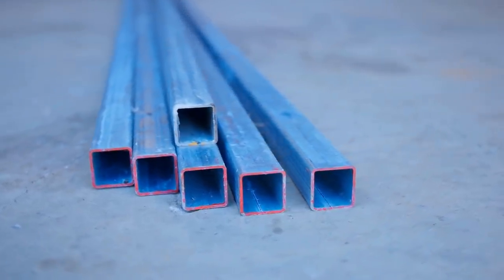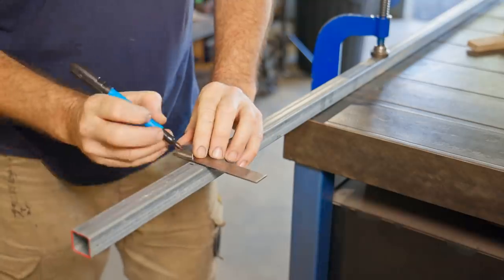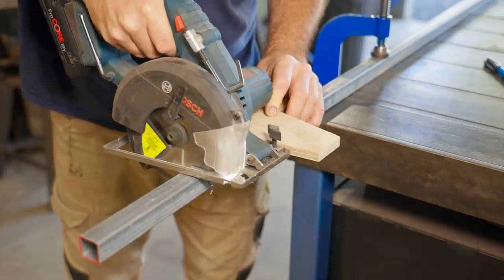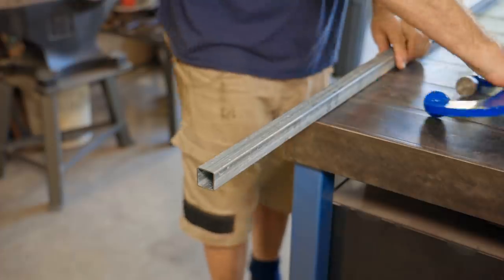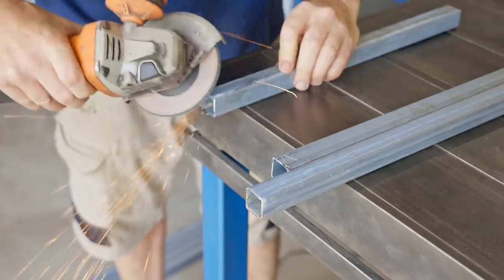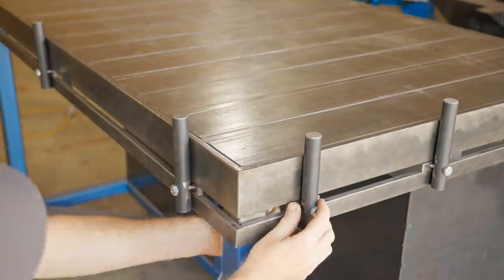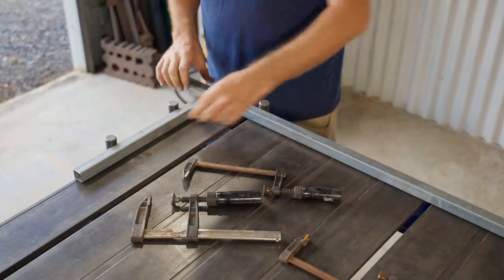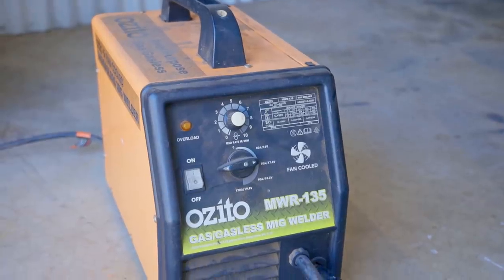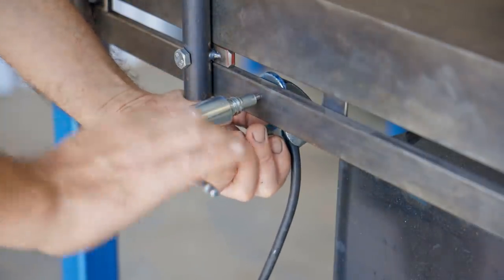I'm making the frame of the panels from one inch galvanized box section and I'll start by cutting the pieces to length. I mentioned these new weld clamps in my last video — they're extremely strong and all steel constructed. If you're in Australia and looking to buy some, you can get a 15% discount with the code PASCMAKES and I'll put a link in the description. Because I'm welding galvanized steel I'll do that with flux core wire, which works much better than using gas — that's why I still have my old cheap welder just to run as gasless. I've just given it an upgrade with a new earth clamp, which I reckon is probably the best thing you can do with a cheap welder.